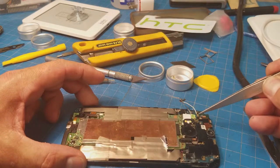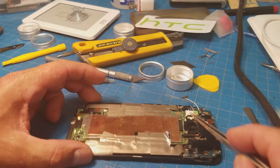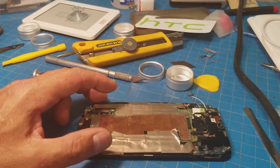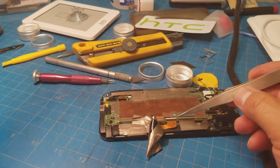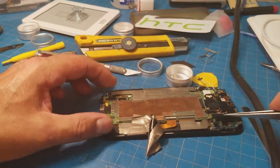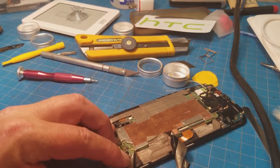On the other side there is a pair of connectors, probably Wi-Fi because they're in a pair, that go over here. Now I've taken two screws out. It's time to pull up some tape, and that tape is covering up two ribbon connectors as well as an antenna cable that goes all the way up here, so we're just going to pop this off for now.